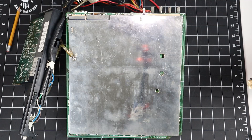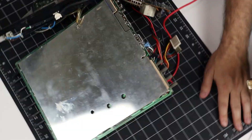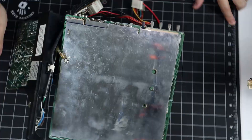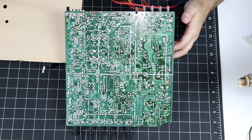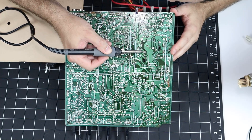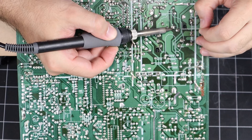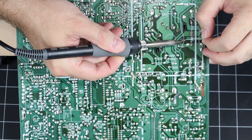Fortunately, this model only has a single RF shield. It's soldered in place in a number of spots along the ground plane, and several of those areas have previously lifted from the PCB. Removing it isn't too bad, but it's attached to the power supply and the neckboard by relatively short soldered grounds, which is a nuisance. When I repaired this monitor before, it was one of the first projects I had undertaken on my retro computing journey. I only had an old $15 RadioShack soldering iron and lacked experience at the time. As a result, some of my work was — let's say — subpar. Since I'm in here, I want to clean things up using proper equipment and an improved technique in order to eliminate bad joints as a contributing factor.